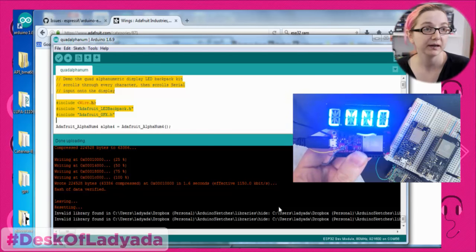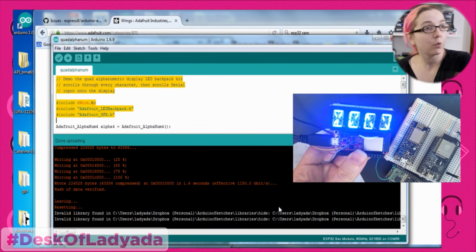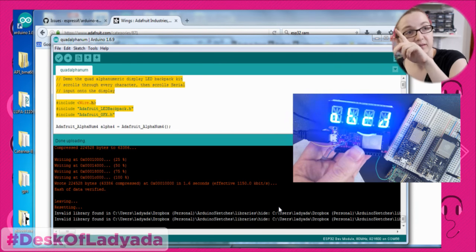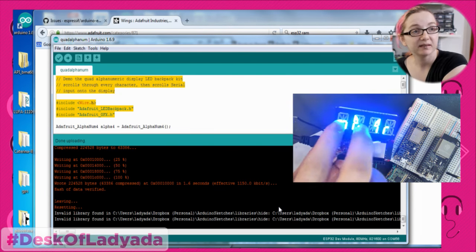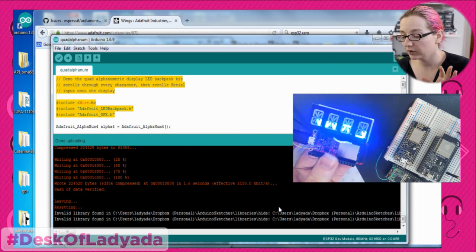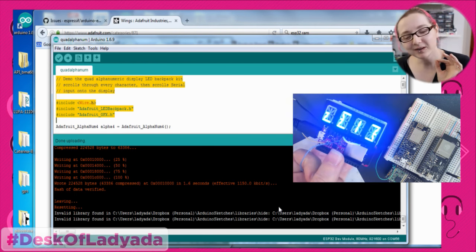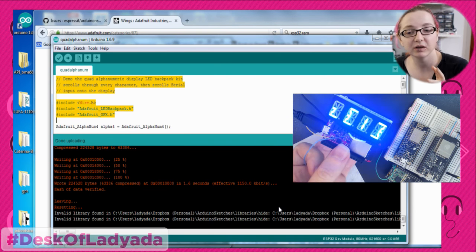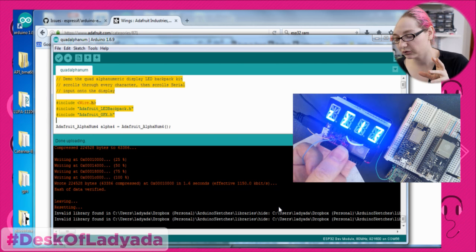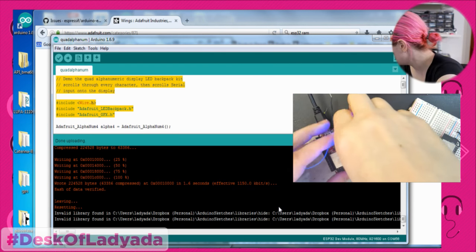We basically put in a font. So this is great. What this means is about a quarter of the feather wings work off the top. All the alphanumeric, 7-segment, 8x16 LEDs. So that's really great. You'd think, well, I2C is I2C. But that's not always true. There's always a possibility that there are slight variations in the I2C implementation. I've learned never to assume and always to triple check. So this chipset is golden.